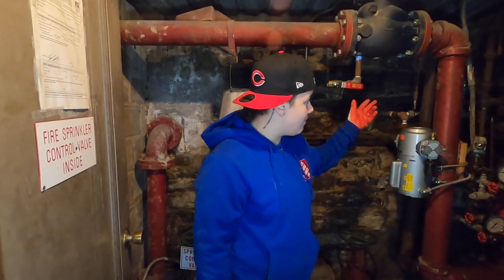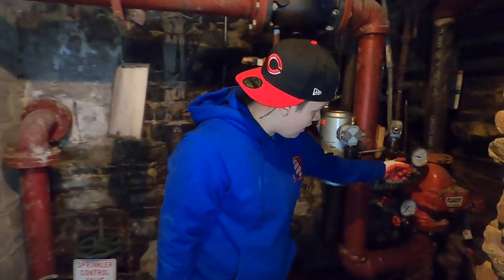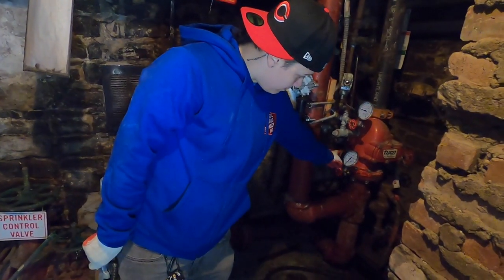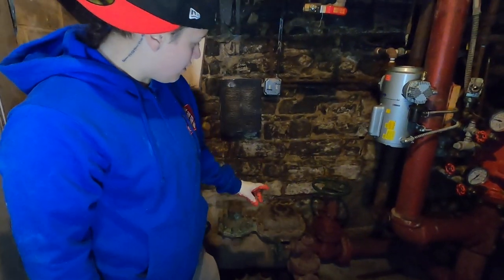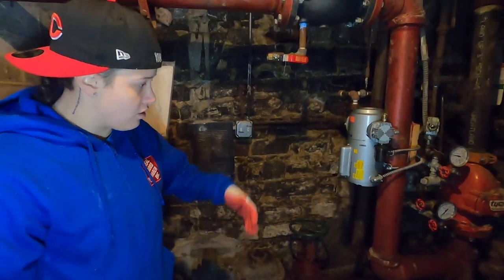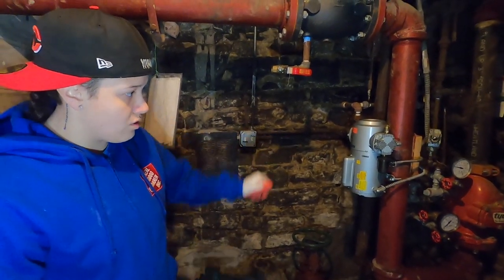As you can see, on the dry side we have 15 pounds and on the wet side we have zero pounds. You want to open up the water — do everything on the dry side first, then open up the water and do the wet side after everything is confirmed on the dry side.